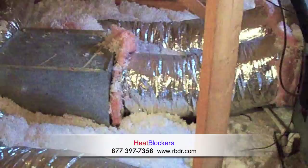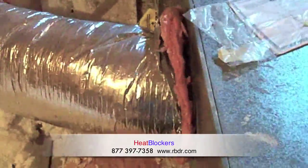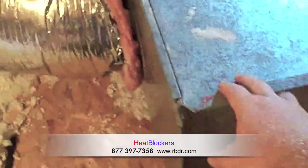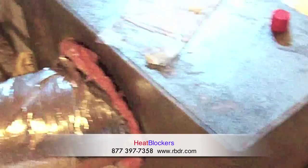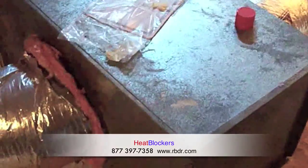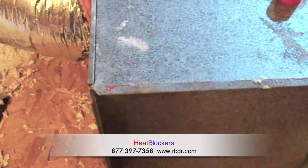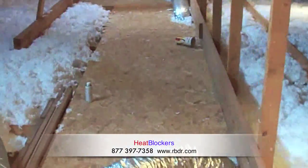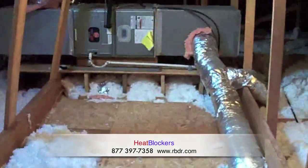This house was built in 2003. The codes changed in 2005 to have the ductwork sealed from the outside with a mastic or expandable foam. As you can also see, this plenum is not insulated on the outside. It is insulated on the inside, but unfortunately that's not enough in the hot attics here in Texas. One of the problems that happens whenever the plenum is not wrapped on the outside is you get condensation that develops because you have cold metal and a very hot attic. So you're going to get some moisture, and what happens is the tape that the plenum is sealed with starts to come back.